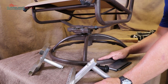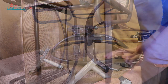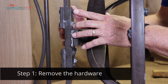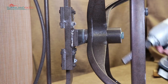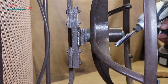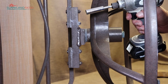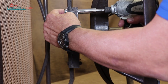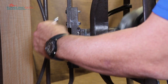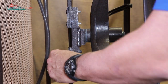Now let me show you how to do that common repair of replacing the fiberglass spring plates, like we'll do on this chair. First, what we need to do is remove the hardware — the bolts holding all this assembly together. Take a picture with your camera, or if you have another swivel rocker you'll be able to reference that when putting it back together. It's always good to have an example or to refer to that photo. You could use a socket wrench — I have this drill set up with a socket already, so I'm going to take the easy way out and just remove all this hardware.